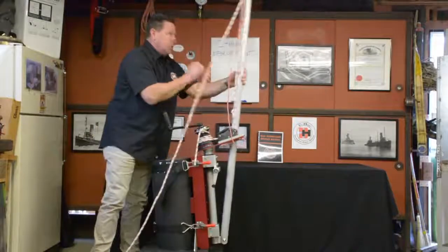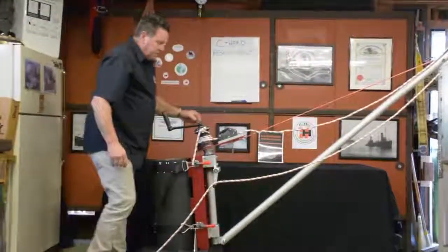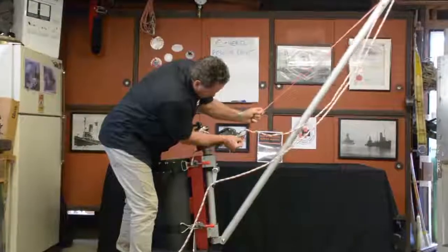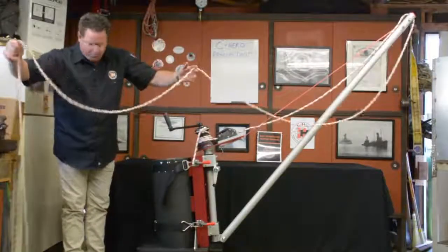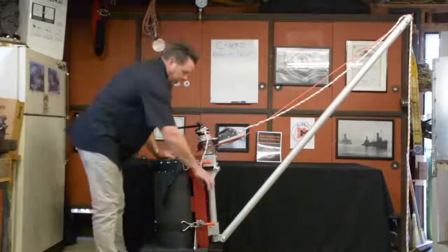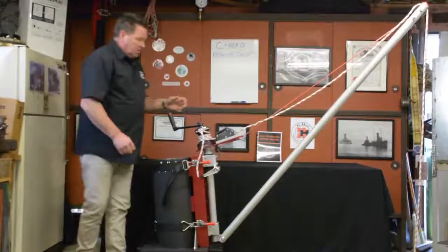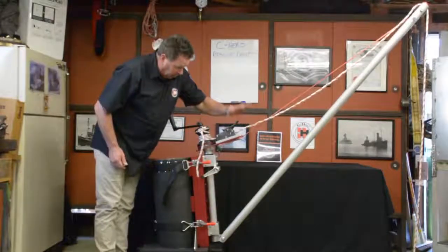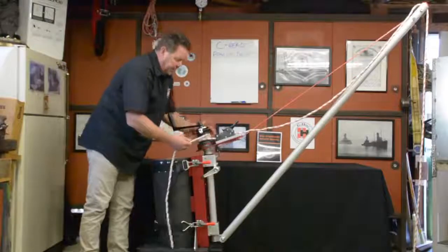Now we're going to deploy it. We're going to hold onto this red line and we're out. If we wanted to adjust that line, we're going to lift it up and take another wrap. The line goes out — attach it to your rescue pole. We're going to heave it in. When the stopper ball comes up, you're done. Bring it aboard. If you need more height, you can crank it up one more time. When you want to pay out line, when the person is aboard, let the rope clutch go out first — open that — then take your line off the bit and let it slack out.